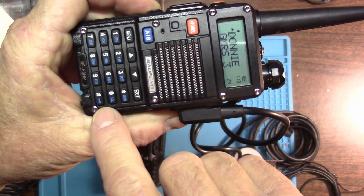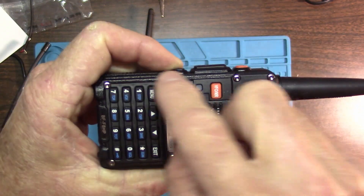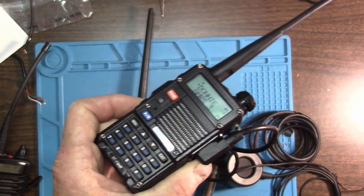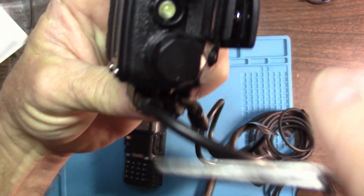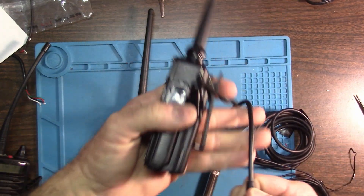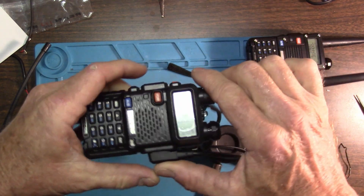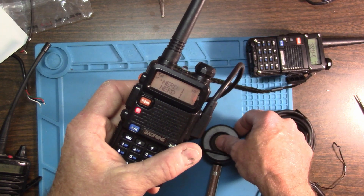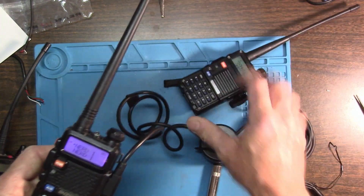The radio is not keying up. You can see more closely it's got these little torque screws - so it doesn't have a metal faceplate. This may be painted black, but any of the radios with these little faceplates have this interference problem. It's just bumping down here so it doesn't work. Now I can change this to a different wire and it'll clear, or you can shave some off. But when I plug into the UV5R, it's still tight, but it keys up. We're having a case interference problem.